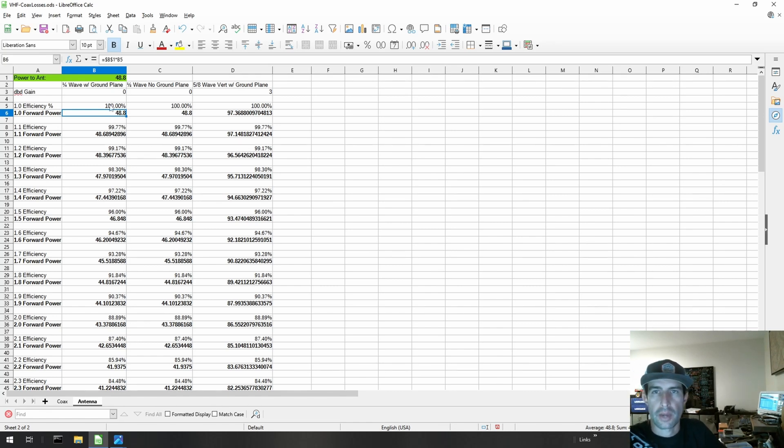There are three different antenna types shown in the columns. The quarter-wave and half-wave antennas offer no gain. Gain is similar to the dB loss we talked about with coax — remember, for every 3 dB of loss you cut your power in half. With antennas, a 3 dB gain means you're doubling your power instead, and that's something we're going to see on the 5/8 wave antennas.